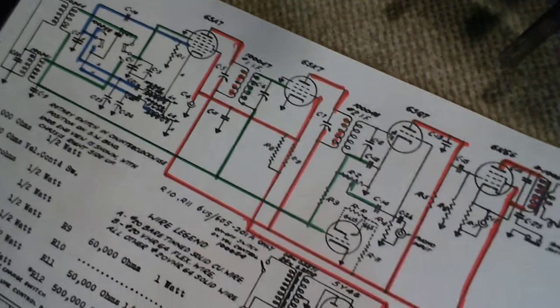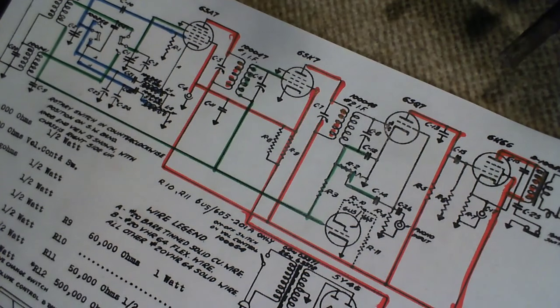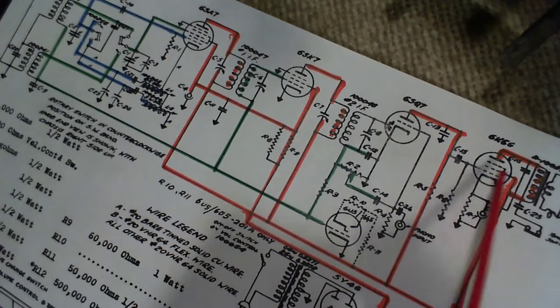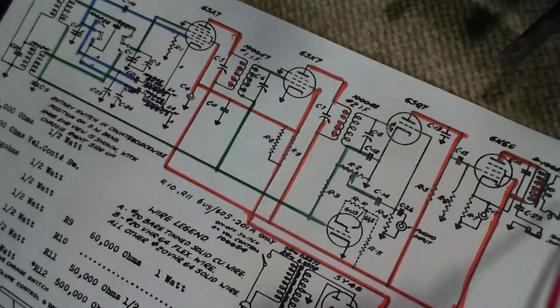The radio will work fine. You won't know about it until you're busy replacing the output tube or who knows what else might be happening. Maybe if you crank the radio up to a very high volume, you may start hearing some distortion because the signal is driving the grid right out of negative and right into positive. But generally speaking, this is a quiet, silent killer.